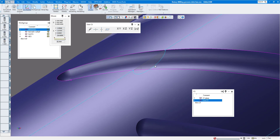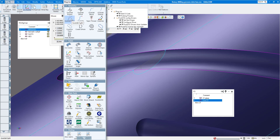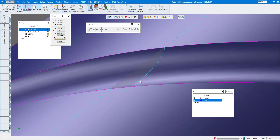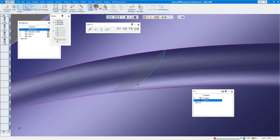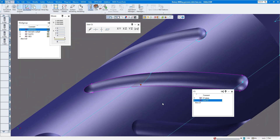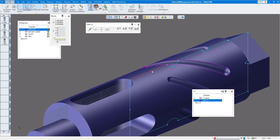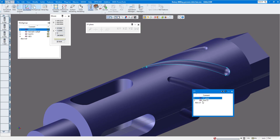I need to get to the halfway point of the groove. Clicking on the geometry, the label shows B9 — that's a spline, so it's a G1 move rather than a true circle. I'll go to plugins, click geo edit splines, do equally spaced, click do it, and now I have a point exactly halfway through the slot. Checking mouse position, it reads 0.875 — seven-eighths from center on a two-inch part means one inch from center, so that's exactly one-eighth of an inch deep.